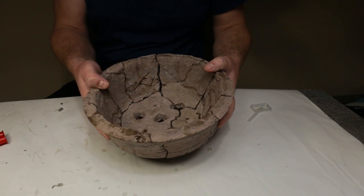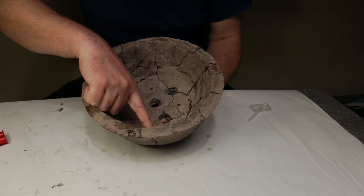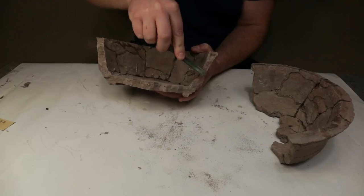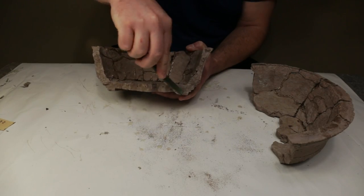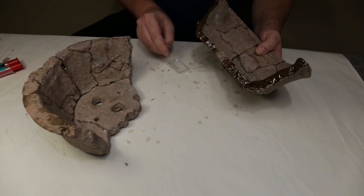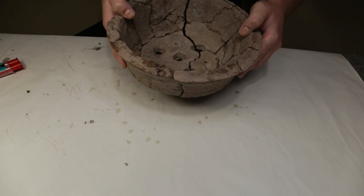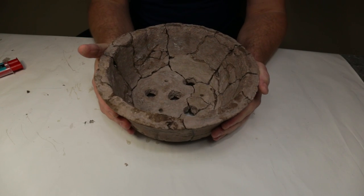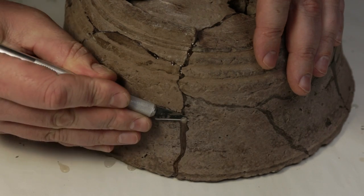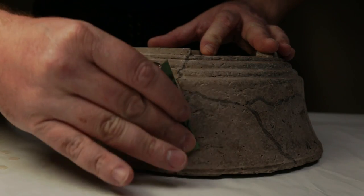Small imperfections in the positioning of glued pieces may cause slight misalignments of other segments. For this you can use sandpaper to remove any high points that might cause such misalignments. Luckily, I only had to do this once just before the final glue-up. In preparation for the kintsugi-style highlighting, I removed all the remaining excess epoxy from the glue joints and applied a light sanding with 1000 grit sandpaper.